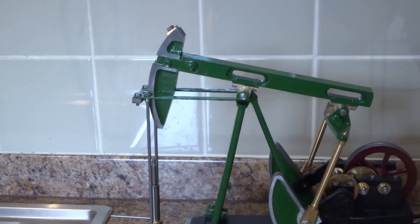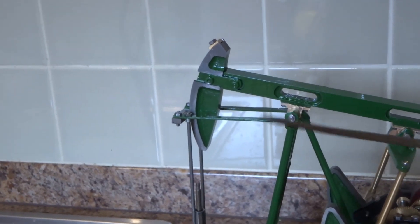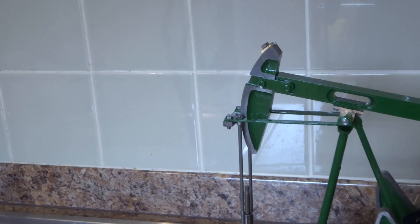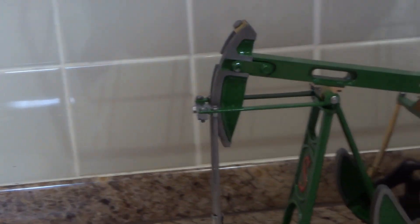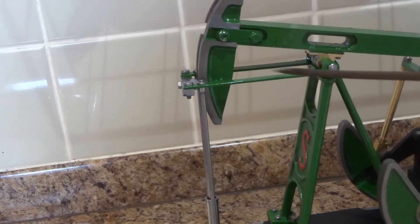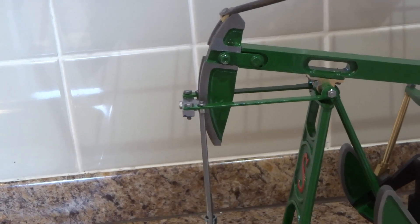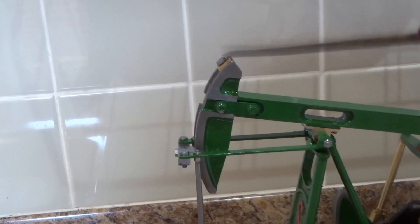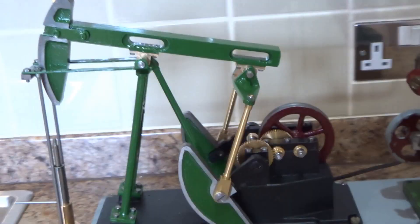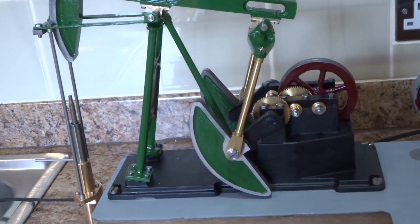What is wrong is that the vertical movement of the pump end of the beam is far too great, with the result that there's interference between this nut and that. Also, what will be the locking arrangement for the two steel straps is interfering with this part, and it seems to me that the throw of this crank is far too great.